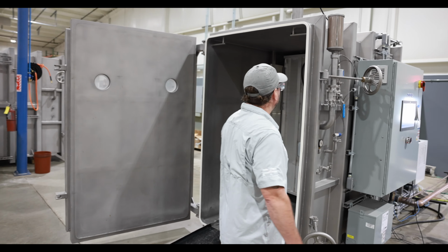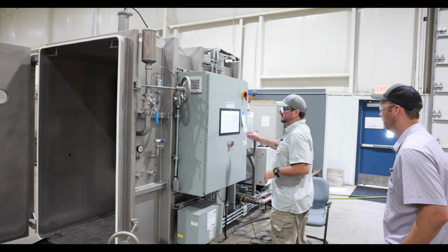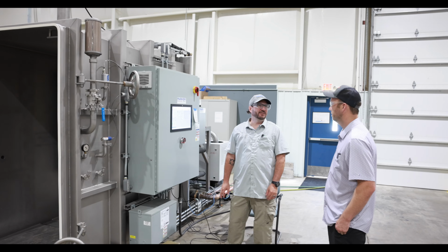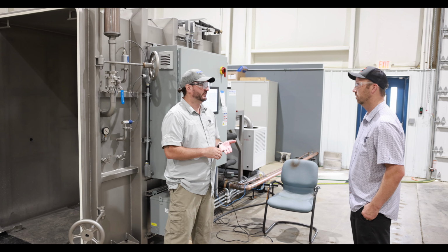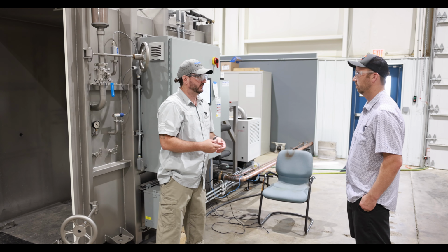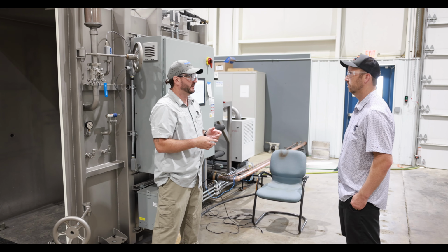If we were gonna be operating, we would seal everything up, come over to the HMI panel, call up our recipe that we used previously, hit the start button, and then walk away. Hopefully come back 16, 18 hours later to a completed run. Once you've been trained on how to operate the system and how to program your recipes, during our commissioning, when we visit your facility, we'll be going through how to read all the different KPIs and all the different indicators.